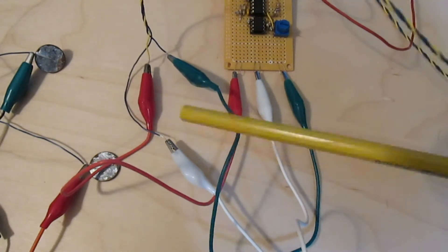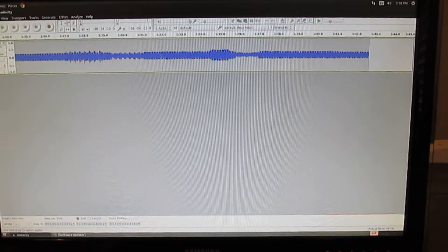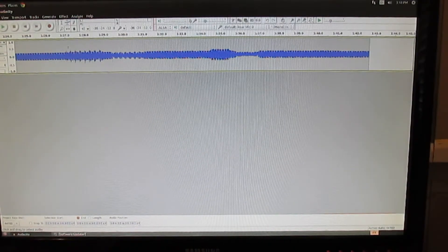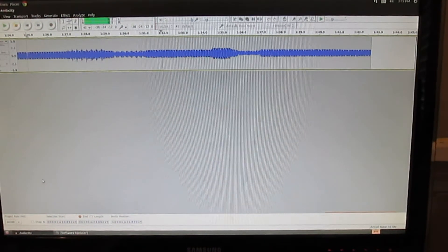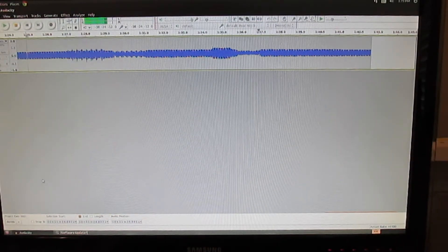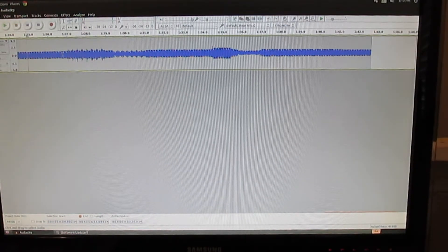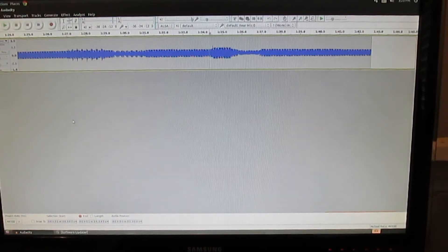So I'll just have to pay attention and try to separate that effect from the cable rubbing effect. I'll tap on these a bit. You can see I was picking up different amounts of 60 Hz depending on what wire I was touching, and here's where I was tapping on it — you can see little lumps in the 60 Hz. It does seem like there's a little bit of the same effect. I could still hear the taps and a little bit of the rubbing in these sections, so it does look like the same thing is happening with those alligator clip wires.